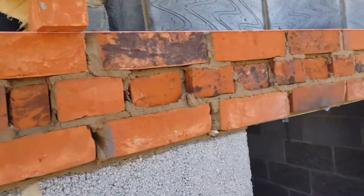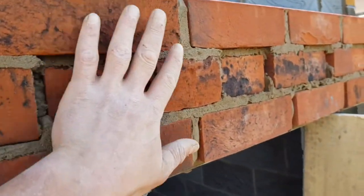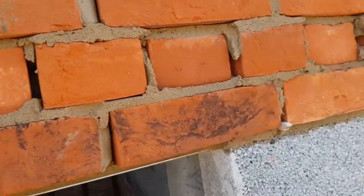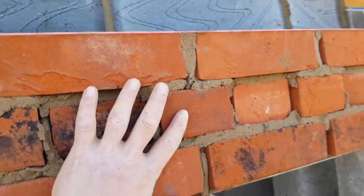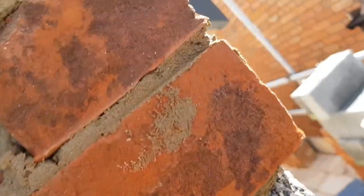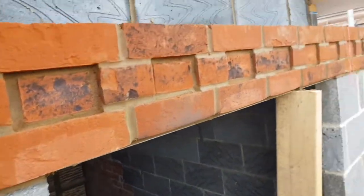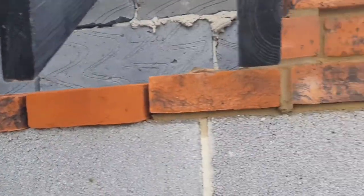We've done our three courses of pattern - don't look too bad, definitely needs a point in a minute because it's a bit wet. These bricks are a bit saturated still, so definitely need to point it and then probably leave it for a bit once the concrete's on top. Put a little prop here, it's all starting to lean a bit forward, so I've put this here just to help it - I probably should have done that in the first place. We'll get this pointed, have a cup of tea, and then we'll do the block work and the returns as well. So we have pointed this up - still wants a bit of a brush but overall not too bad at all. Now we'll just do the return.